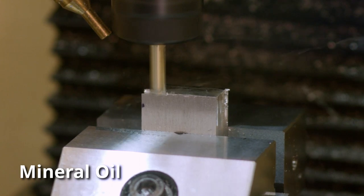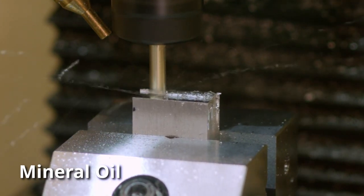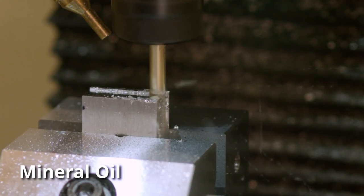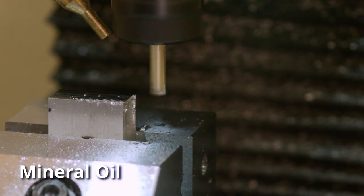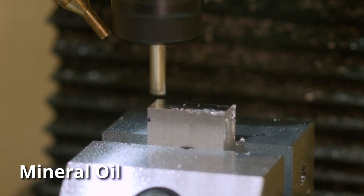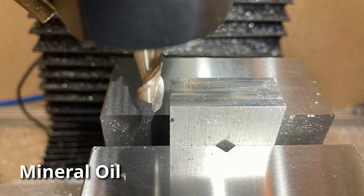The next thing I tried was mineral oil. I've heard this is used as a cutting fluid on aluminum and I had some on hand — just your typical food grade mineral oil. You can see as it's cutting that the chips are sticking a little more than on the ethanol cut, but overall the surface finish is improved. From this angle it looks actually pretty good — very close to being a nice mirror-like finish. From another angle you can still see some faint semi-circle artifacts, but they are pretty minor. So mineral oil seems like a good option. It's cheap. One thing I have heard is that if it's misting in the air it can be bad for your lungs, though I'm not sure how much that happens when you're just applying it once to the workpiece.